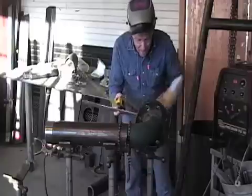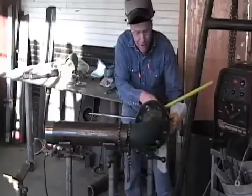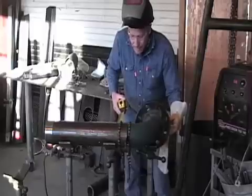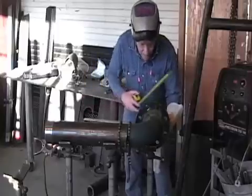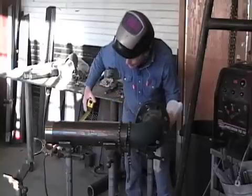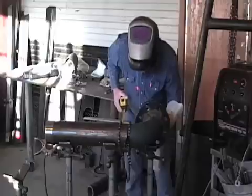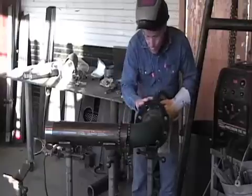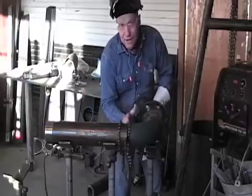So what you do — I showed you last time when you fit this — you run a straight edge. I've got an aluminum two-foot framing square. You run a straight edge off the face of your flange, right about the center where this tape measure would hit the pipe. I've got seven and an eighth. You check it as far out as you can get your square by keeping your framing square flush on your face. You check it at the front one place and then at the back one place. I've got about a sixteenth inch — less than that, maybe a thirty-second difference. So I'm not going to fight with that. What I'm going to do is tack the top, my two-holes good, and then secure the back side with a heavier little weld and it'll draw that sixteenth out before I tack the inside and lock it all in place.